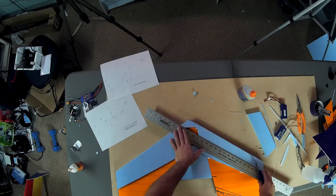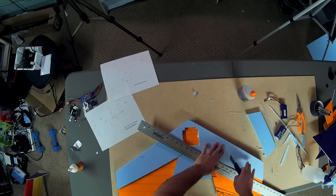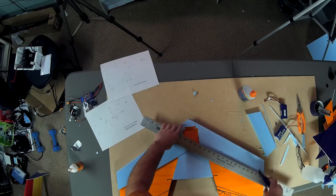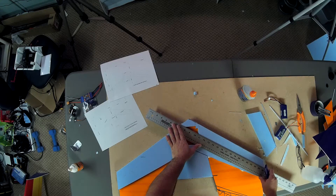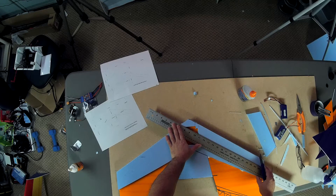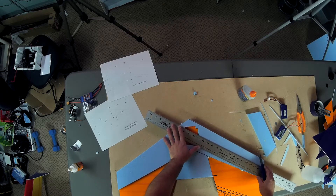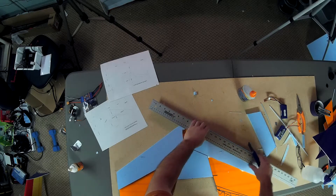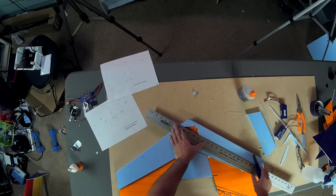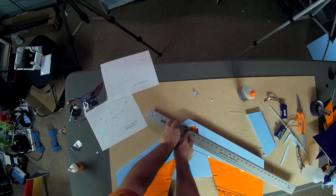So what I like to do is cut up to half of the width of the step, then at an angle so that you pretty much intersect halfway down the front — that would be the ultimate goal. I'm going to be cutting basically this entire nose piece off, which I'm not terribly happy about. Usually I'd give it up to two inches; I'm going to give it just a touch less than two. I'm just going to do it and ignore the repercussions. This knife is not nearly sharp enough, but it'll get the job done.